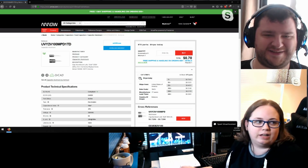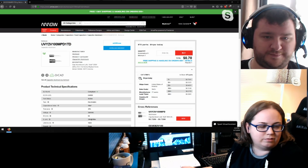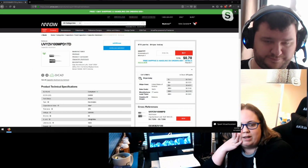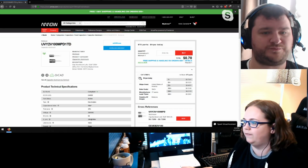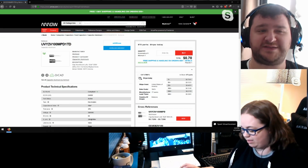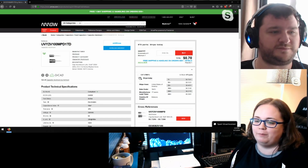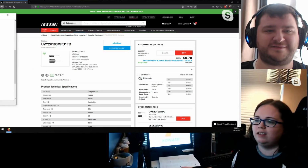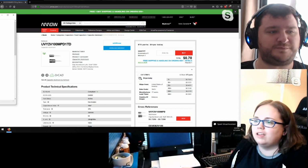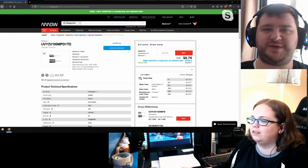I would have to actually look at the chip on there. I think the RGB is a Sony chip in there. So that would be possible if it's the CXA. One sec, I actually have it on my desktop. That's awesome. It is a CXA1645M. Yeah, so you should be able to do it then.